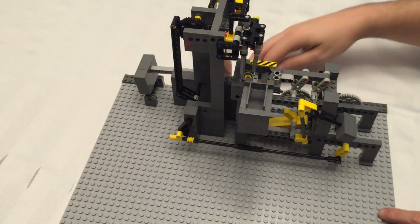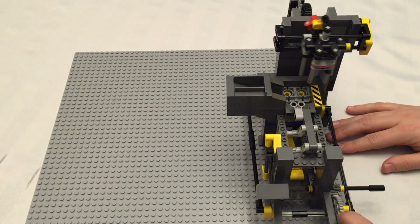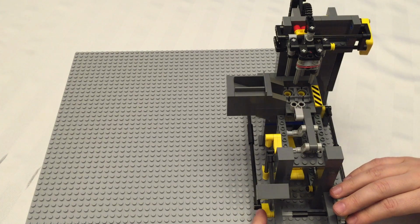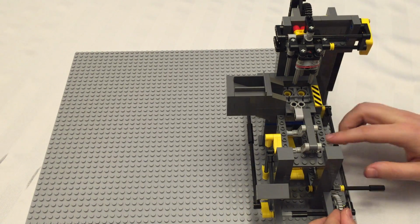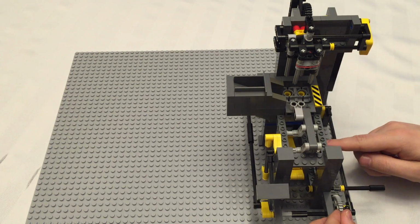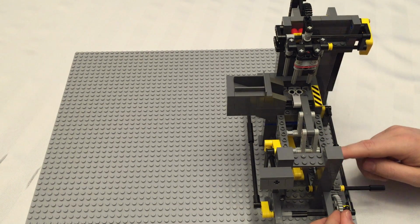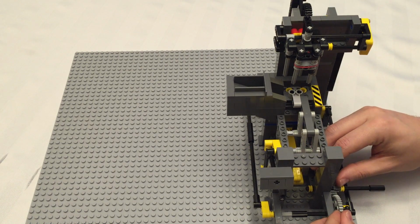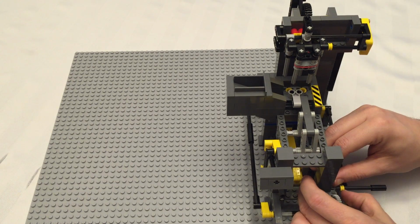All right, so that's set up. Now, turning this gear, let's get it right to where it's ready to pick up. Just before this is pointing straight back, so just a little shy. And we're going to turn this, also counterclockwise, to just as it starts to lift. And right as it starts to lift, let's lock that gear in, get everything locked together.